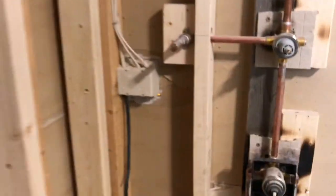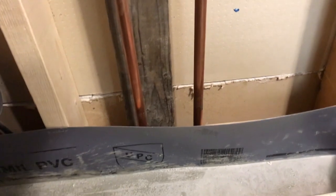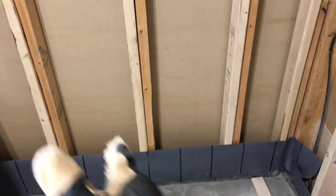When we're doing our cement board, we're realizing that these corners where I bent them in are going to have a little bit of gaps and they're going to push my cement board out in these corners. So when installing the tile I've got to make sure I use a little less thinset on the bottom. What I do to help with that is I install the side pieces first — this side piece and this side piece — and then I wedge the middle piece right in the middle, which helps push those corners in as much as possible.